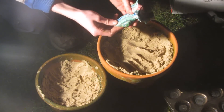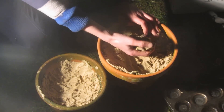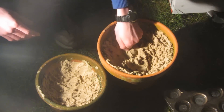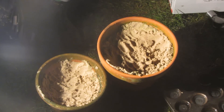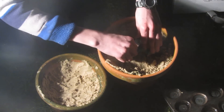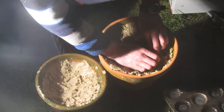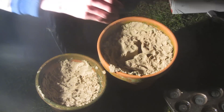This is a nice shape with a good palm swell that fits my hand well, so I'm going to press it into the sand. This sand is very fine kiln-dried sand that's been left outside for a couple of months and is now moist — when you squeeze it, it sort of stays in the shape of your hand and then crumbles away. That's about the right moisture level so that you can flatten it out and it will remember the shape of the slingshot. The good thing about moist sand is that the water boils off without causing an explosion, since it just soaks into the surrounding sand. So I flatten out the top, take the slingshot, press it in, build up sand around it, then slowly and carefully remove it — and there you go, that's the mould.